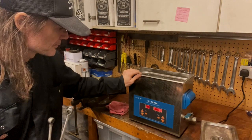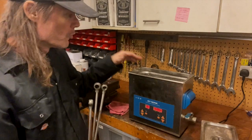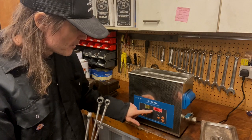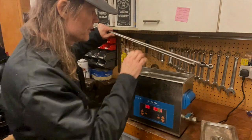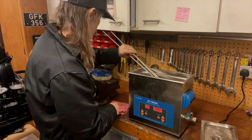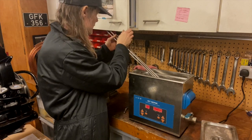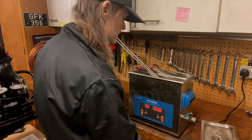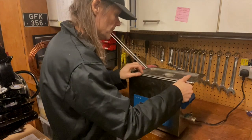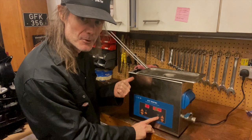The idea is to use the ultrasonic cleaner I bought for 70 pounds off eBay. I've filled it with liquid - 20 parts water to 1 part cleaning solution, using warm water at about 38 degrees from the tap. I've set it to heat up to 80 degrees and set the timer for 90 minutes. I might put a rag under here to cut down the noise - when you fire it up it makes a hell of a noise. We'll come back in an hour and a half and see if that hardened burnt-on flux has been removed.